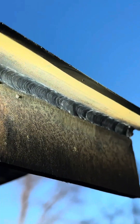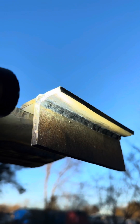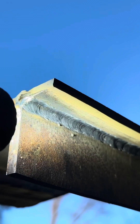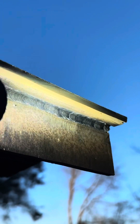Alright, so this is my first pass. Whatever rod angle you decide to use, just make sure you're tying into the top and the bottom symmetrically. If you focus only on the bottom you might miss some tie-ins on the top, so just periodically bounce back and forth and make sure everything looks good. Alright, we're going to go ahead and put in our second pass.